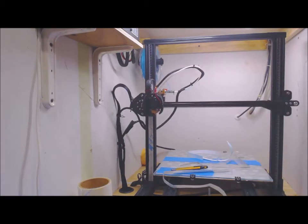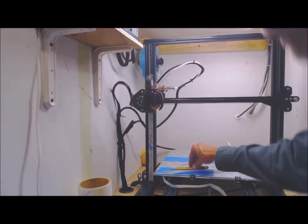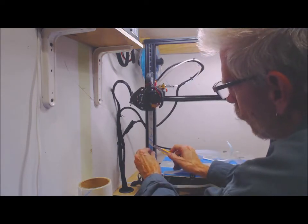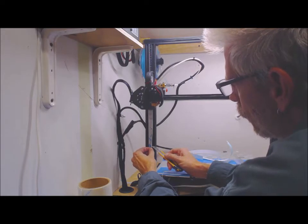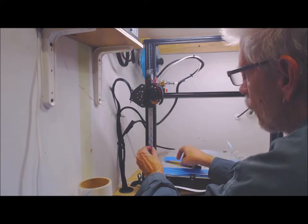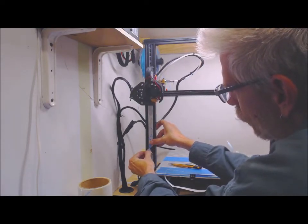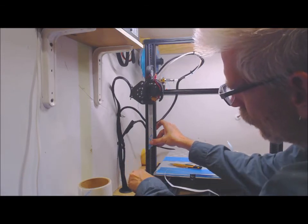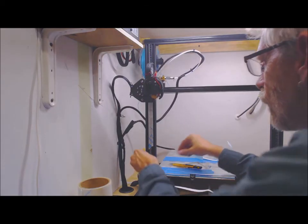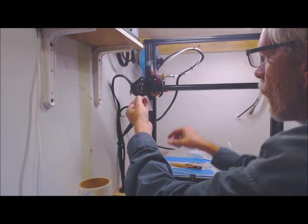Now you can go ahead and raise the gantry out of the way so that you can continue peeling the rest of the application tape off. I got a little impatient, so I went ahead and cut a slit on the side of it, being careful not to cut into the decal itself, but just basically to separate the application tape from the decal. It is a low pre-mask application tape, so it makes it kind of easy to peel away, but be careful that you don't lift the decal with it. If you rub down good enough and you clean the surface good enough, you shouldn't have any issues here.